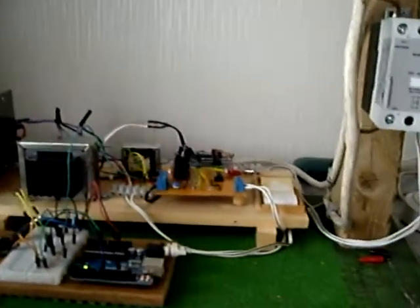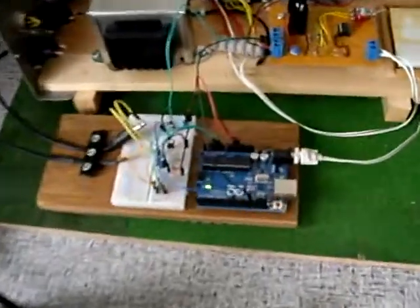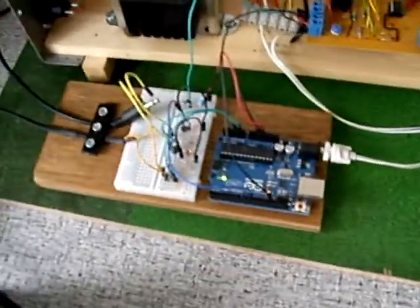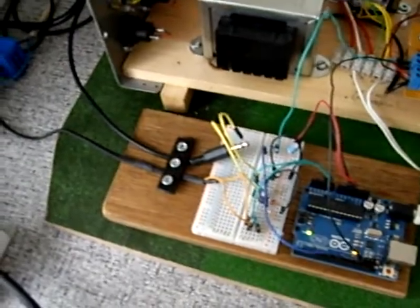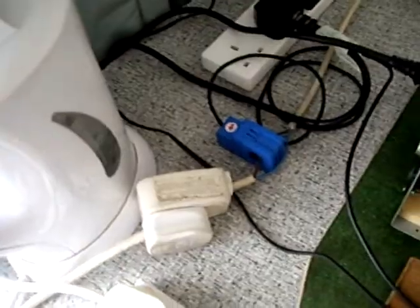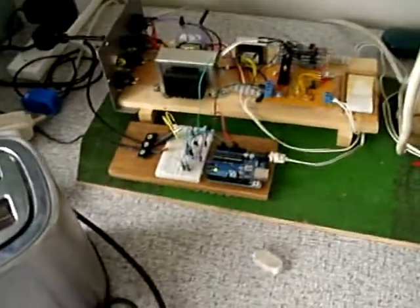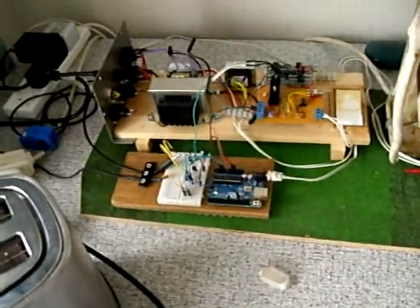The enhancement since yesterday is that I've got a switch. If I turn the switch, now instead of a test circuit I'm actually connected up to an Arduino here, which has a current sensor. It also has a voltage sensor, which I'm not using. The current sensor goes down to a modified extension lead which supplies two items that can draw a load. At the moment we're not drawing any load, so the sketch in the Arduino is correctly interpreting that as: don't switch on the output.